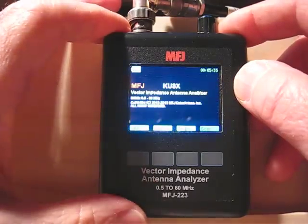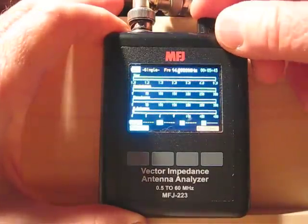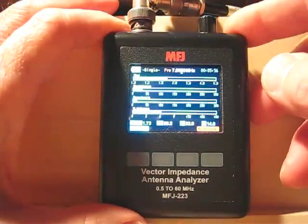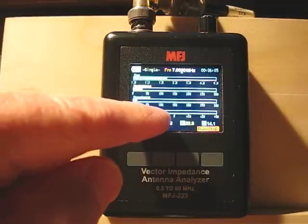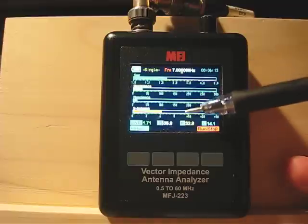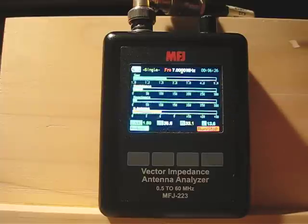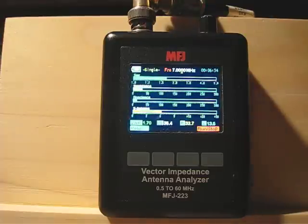Backing up with the return button takes us to the single frequency mode. Now we're doing just one frequency. It went back to 14 megahertz so we dial down to 7 megahertz. Move the cursor and hit run — it scans at 7.000 MHz, showing about 1.75 to 1 SWR, with resistance and reactance displayed. At the bottom there's a signal strength bar with the antenna icon — that red bar has to stay below the +10 dB mark. There's a +10 dB and a +20 dB level shown. It's reading RF in the atmosphere, and if it climbs between 10 and 20 dB you're overloading the unit and should immediately stop.